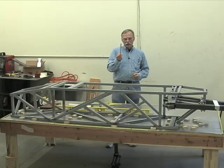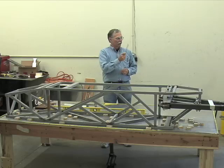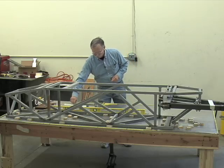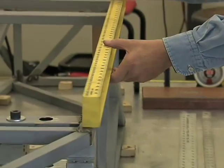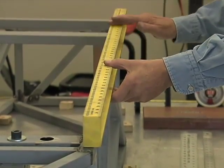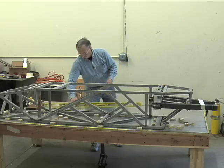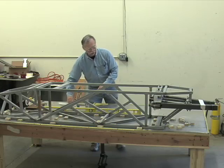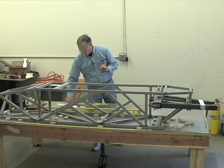One way we avoid that is that we use accurate rules, one. Two, we select rules to scale. For example, if I wanted to measure something this long, a one-piece ruler is always the best way to do it. Using multiple rulers and trying to move it, again and again, means tolerance stack, always.